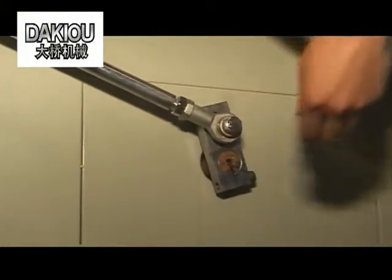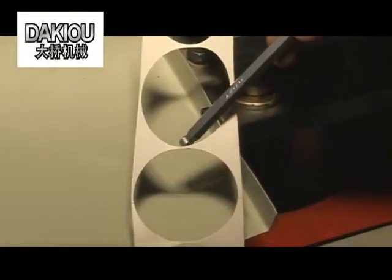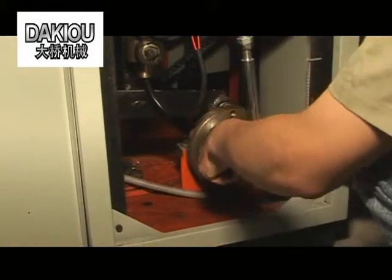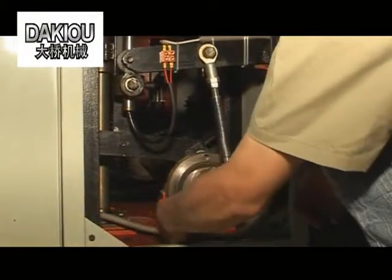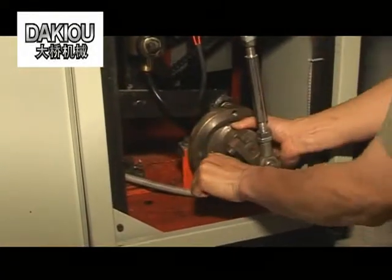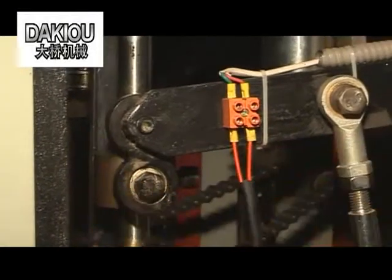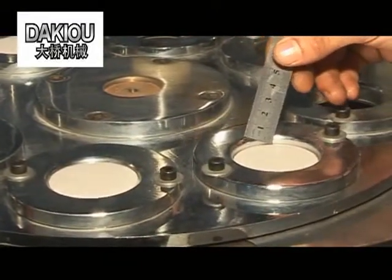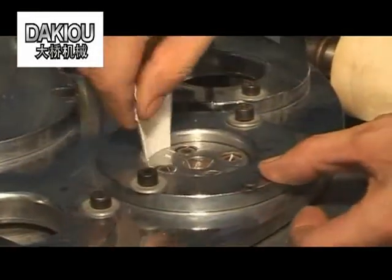Adjust the distance between the upper shaft central point to make a clearance for two cup bottoms. Turn the swing of the lifting shaft for proper lift. Turn the eccentric wheel of the die for proper lift. Make the lifting shaft 6 to 8 mm deeper into the delivery ring if you fail. Adjust the position of the delivery ring and the lifting shafts.